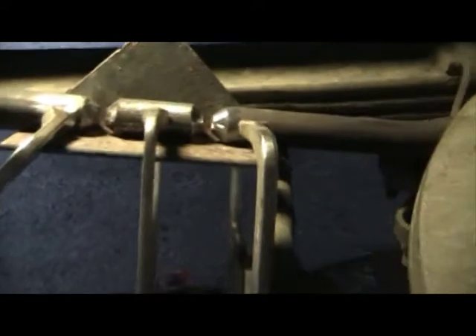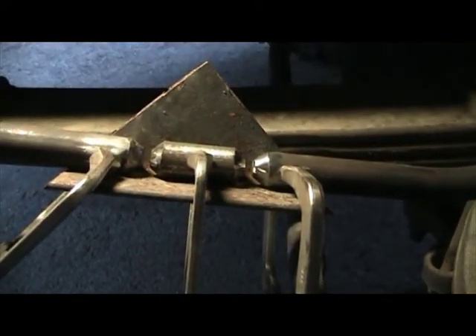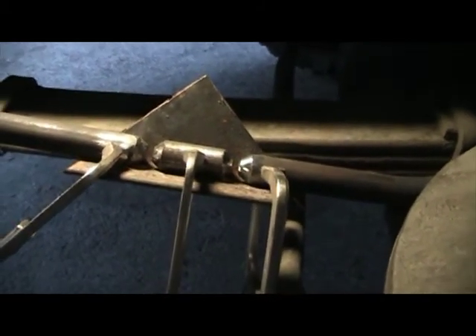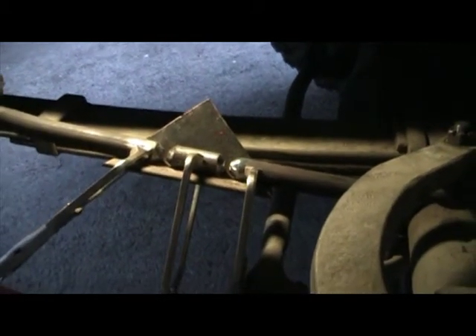The piece that's in there ends up being 2 and 1/8 inches. The gaps there are intentional — for anybody who's ever done welding, you know why. You want to get a complete weld, especially on steering components, something that's critical. If that breaks, you're screwed.